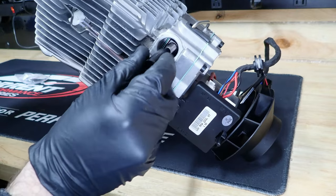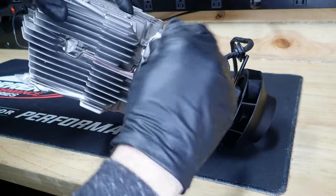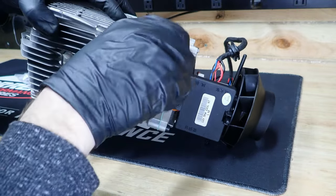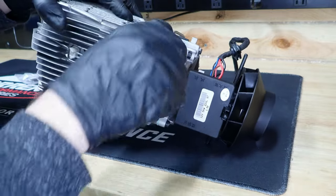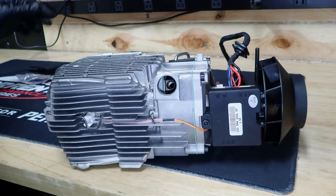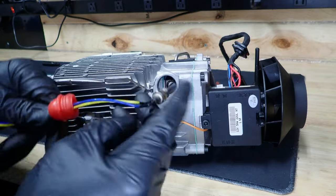If I get you a good angle, this little piece of plastic is just going to push it right down to where it needs to go into the hole to install it, so you don't have to mangle it up. If you try to push it in with a flathead screwdriver or something, you may lose the roundness of it. So if you buy this tool and just twist it, it'll get it round. If it does start to deform, then we'll go ahead and get this glow plug put back in.